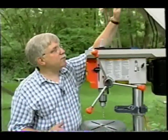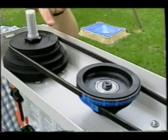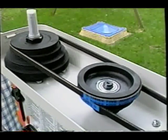One of the other nice things about a drill press is that they also operate at different speeds. All you have to do is lift up the top of a typical drill press like this, and there are pulleys up here with belts. By adjusting the belts on the different pulleys, it can go from a very slow speed to a very fast speed.